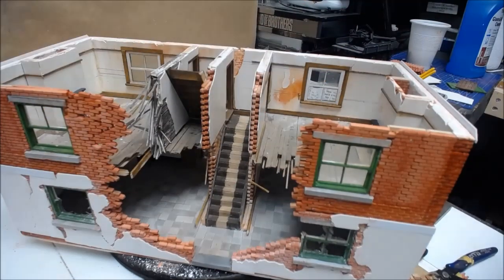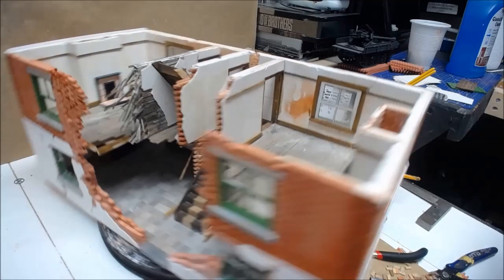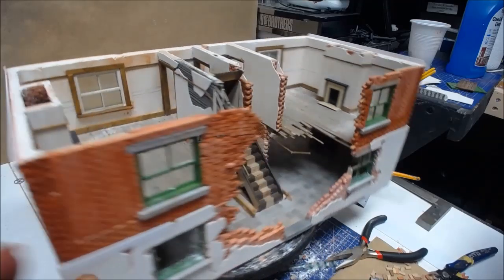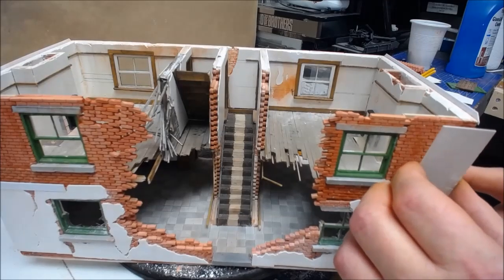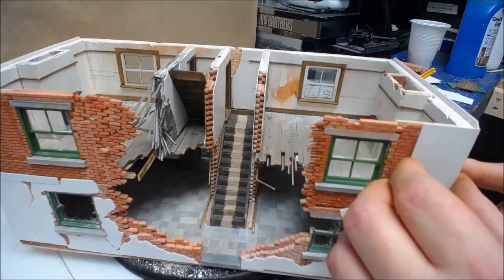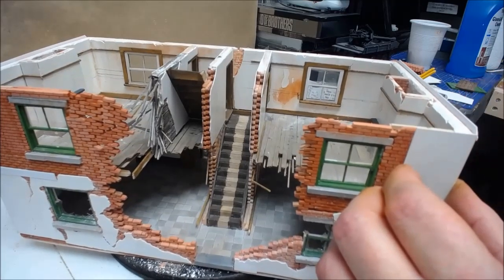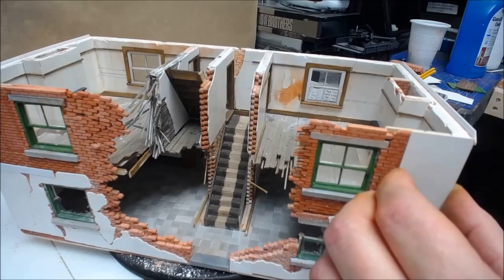I have my two plastic strips on, one on this side as you can see and one on the far side, so everything's good to go now. All I'm going to be doing is the same as I did on the bottom half with my little plasterboard sheets. I'm just going to dot and dab these. They will stick a little bit proud over the top, but when it's all dry, I'll get my sanding stick and that will come down as easy as anything.